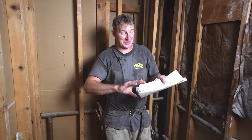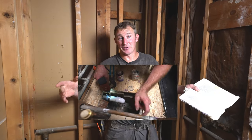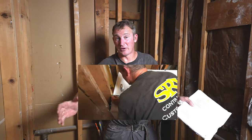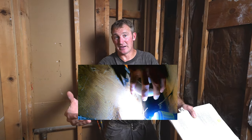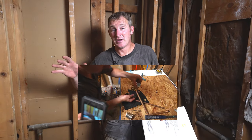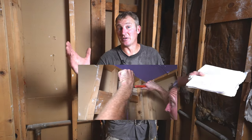We're on day two, so make sure you follow my guide — this is really helpful to keep things straight in your mind as far as what you need to get done. Day two's main priority is getting your plumbing, getting your tub in, getting your faucet in. That is your main priority because everything revolves around that as far as installing the rest of the drywall and everything else. So your main priority is the tub, then your shower faucet, and then we can move on to drywall.